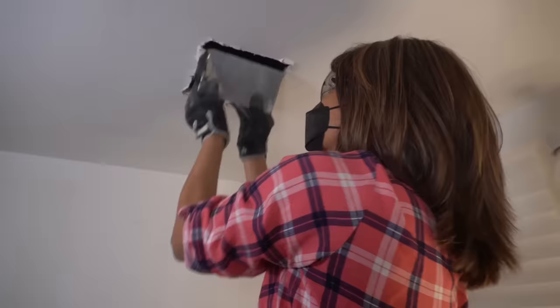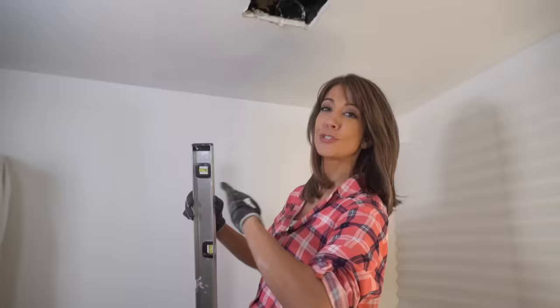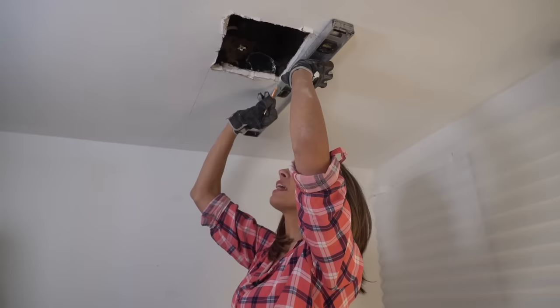After bending back the metal, I can see there's a drywall screw right here holding this up, so I'm going to get my pry and pry this out. Once we've got it to this point, I'm just going to tuck these wires out of the way and pull down the fan. Our wires I'm going to tuck out of the way so they're safely away from our drywall. Now we might have an issue — this is actually not even budging. We need to move this vent over on the left-hand side so it can attach to our new fan. We're going to do some surgery here. I'm just going to trace out where I want to cut my drywall patch — I need to access that vent and see what's happening.